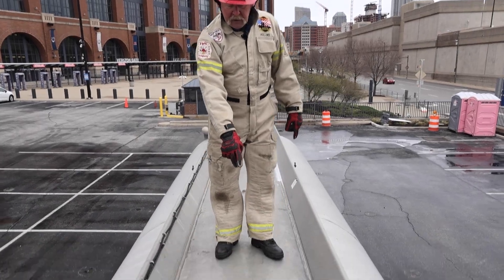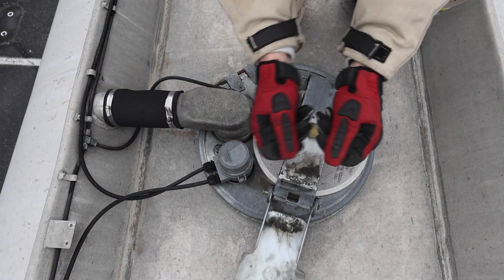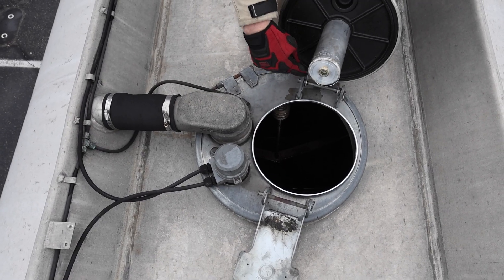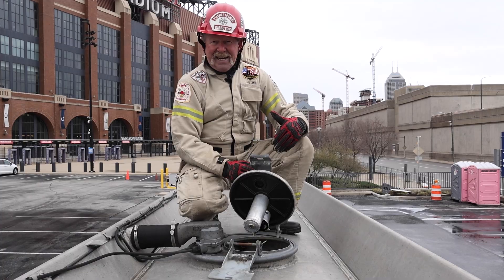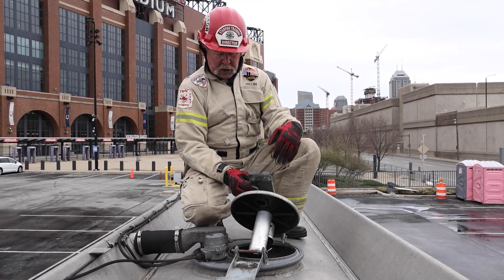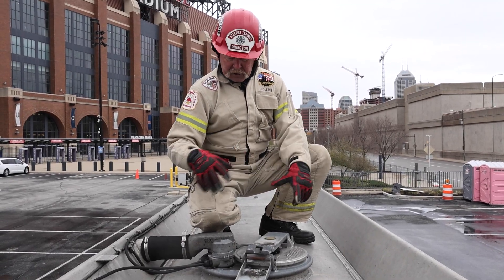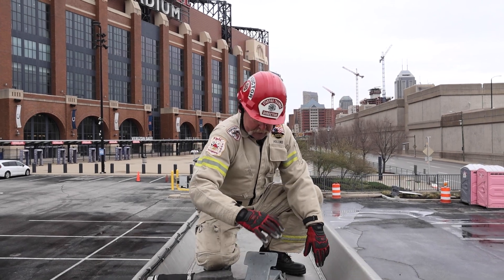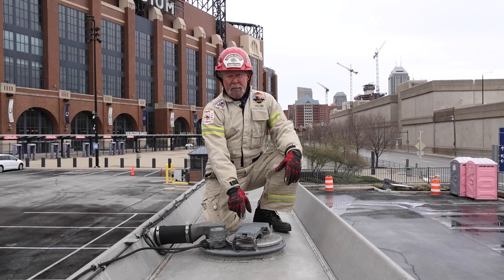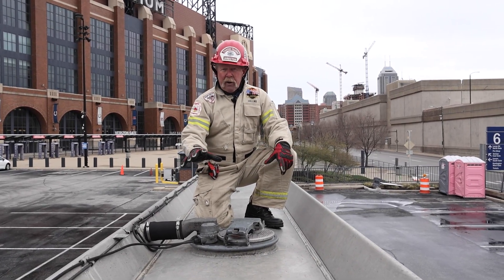There are several components within this small manhole. One is going to be the dome lid right here. This dome lid provides an opening of about 12 inches. In an overturn situation, this is typically going to be leaking. There are dome clamps that hazmat teams use to secure this back in place with the gasket when you have a leaking dome lid. Within this component you also have a pressure reducing device, which will automatically reduce pressure within the gasoline tanker on its own — nothing we need to really worry about.